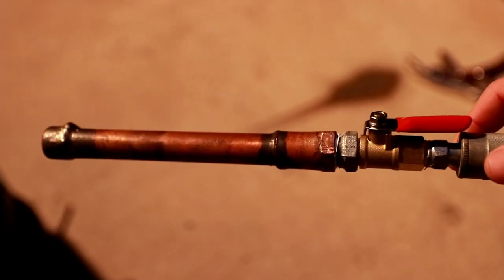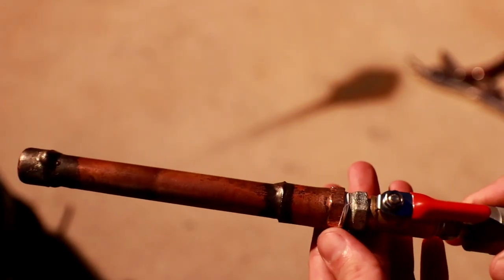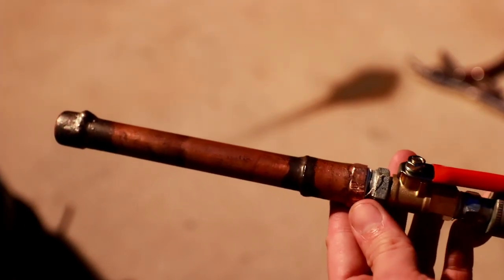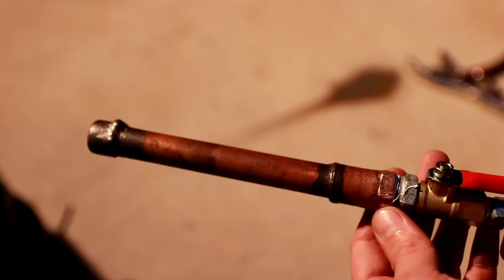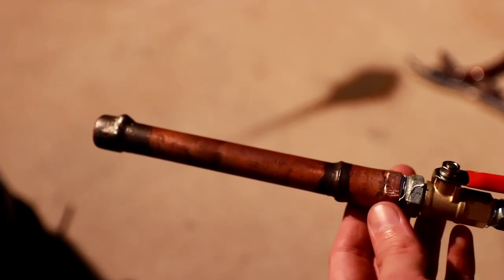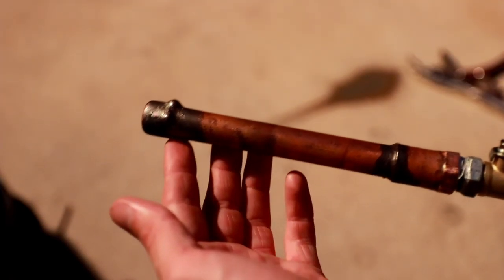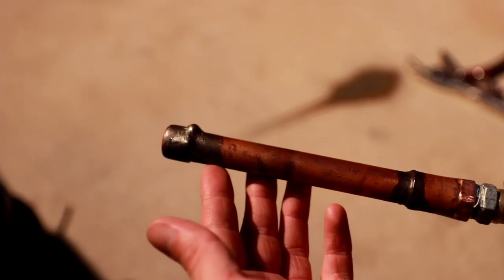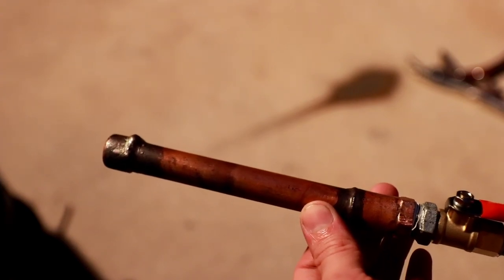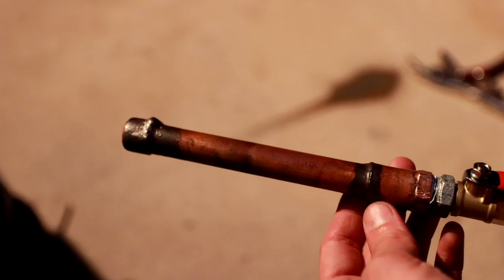One interesting unforeseen consequence of brazing at high temperature around the threaded fitting is it seems to have annealed the copper on the threads to the point that it will no longer hold a good seal and will actually strip the copper if you tighten it down too much. You want to be particularly careful when brazing not to adversely affect any threaded fittings. That said, if you're working line-to-line with just copper tubing, annealing shouldn't be a problem unless you're dealing with an exceptionally high pressure application, in which case brazing may not be the best joinery technique.